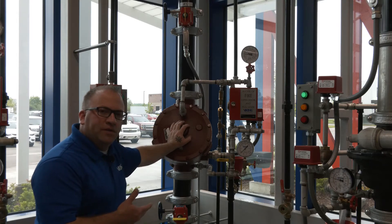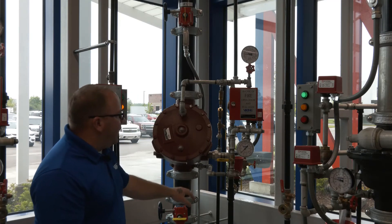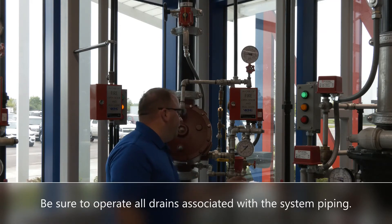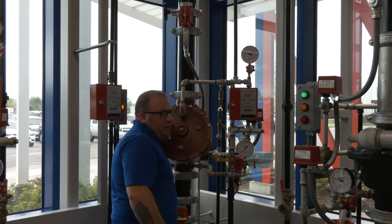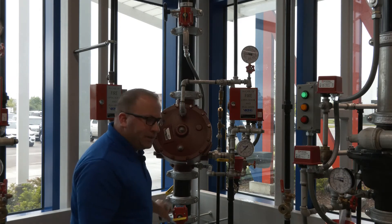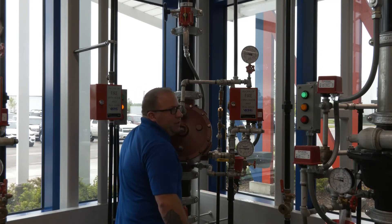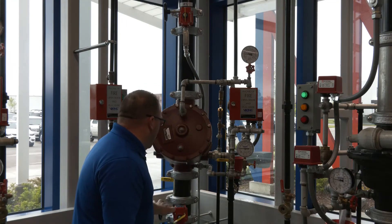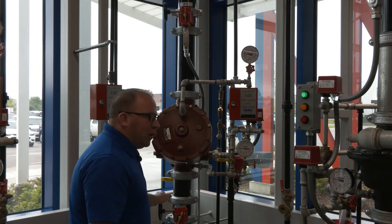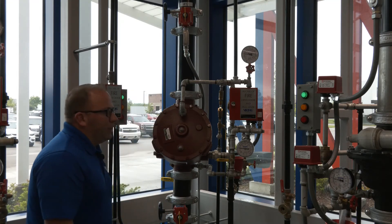With the prime water pressure re-established and our valve in the closed position, we're simply going to restore our water supply and get the valve back into a functioning state. We're going to close the auxiliary drain that communicates directly to the outlet chamber, partially close our flow test connection, then get our system control valve back on. As the system control valve flows some water, we'll close the flow test connection the rest of the way, then fully open the system control valve. Once that valve is in the open position, our deluge system has been completely restored — you'll see we have a green panel.